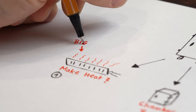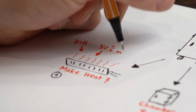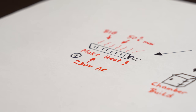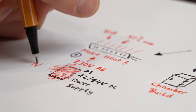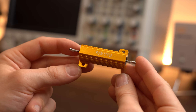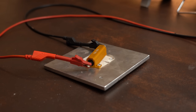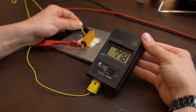The reason is that I wanted a big surface that can only heat up to a maximum of around 50°C for safety reasons. I also wanted to power the heater directly with mains voltage to keep it all as simple and efficient as possible, so I wouldn't need a separate power supply. So the simplest solution of grabbing a big power resistor, slapping it onto a metal surface, and powering that is pretty much out of the question — it uses lower voltage and also gets too hot.